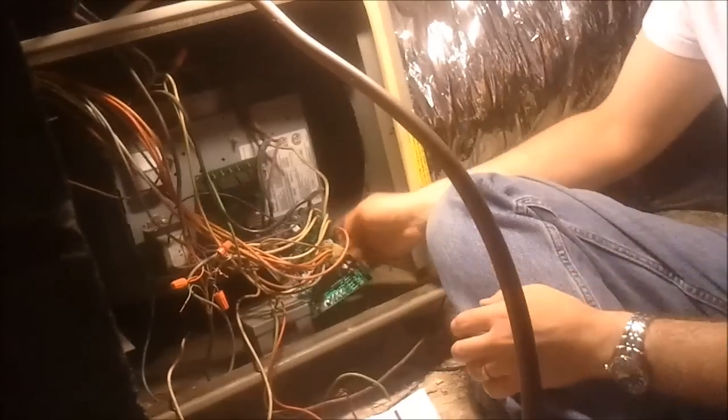We also have to connect our thermostat wires, which we'll do in just a moment. At this point we cautiously remove the old board from the standoffs — it actually fell off two of them. This board includes a spare set of nylon standoffs, so if you damage any, you've got replacements right in the bag. Here's our old board — that's probably original to the unit. We need to connect the thermostat wires — white, green, and red — to the W, G, and R terminals on the new board.